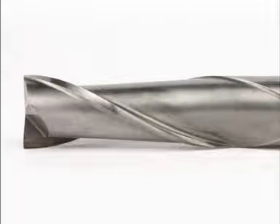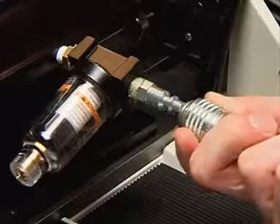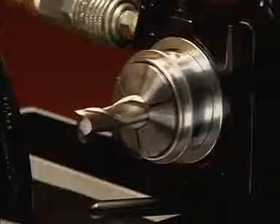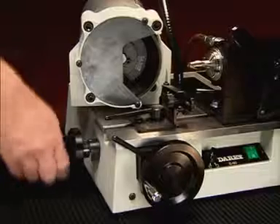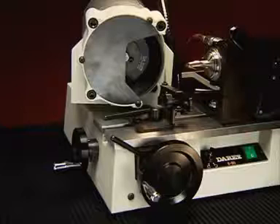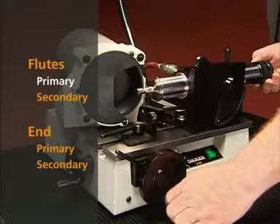We recommend that you learn to sharpen with a 2 or 4 flute endmill of at least 3/8 inch diameter. Before sharpening, you must attach a compressed air source of at least 90 PSI to the air spindle housing. This floats the air bearing to ensure a smooth, uniform sharpening. Before sharpening, you'll also need to set the stylus positions and grinding wheel. We'll show you how to connect the air and set these features later. With setup complete, watch as we sharpen the primary cutting edge on the flutes.